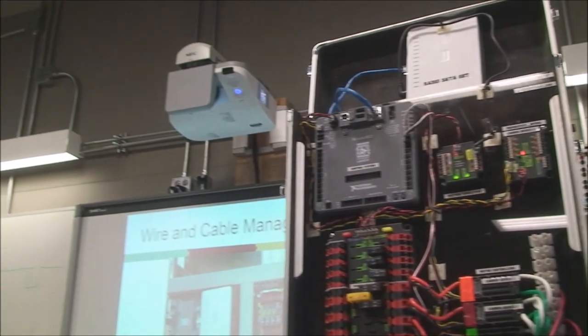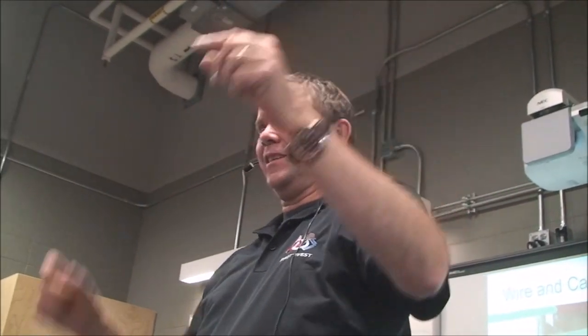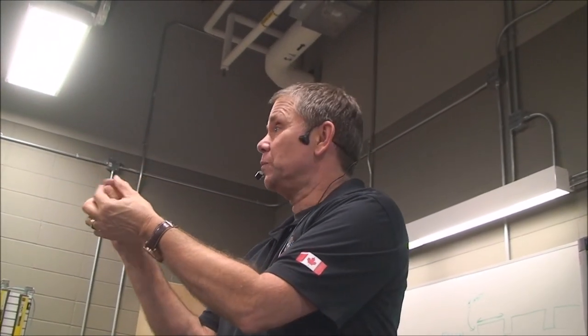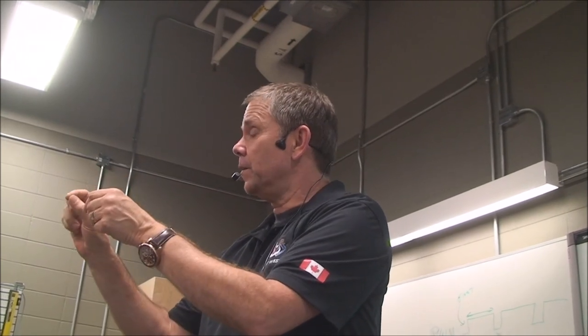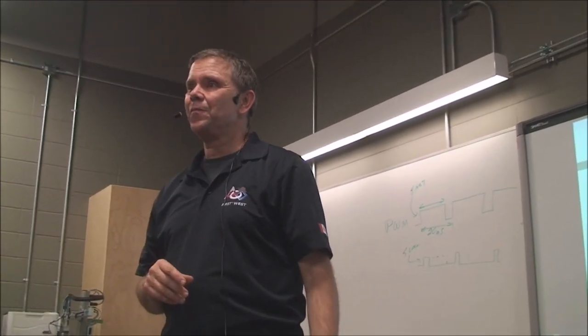And if you look at these stations behind you, you can see all those terminal blocks, every black wire going into them. And the second row has got little white tags. Over there on my robot, on the robot on the cart, every wire going into every connection has got a little tag. And they're actually heat shrink tubes, specially printed. You can use those. Or you can get just wire tags that you can write on, or little sticky numbers you can attach on. But it's very important that you document your wiring so you can do quick troubleshooting if you have to. Okay?